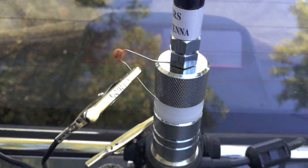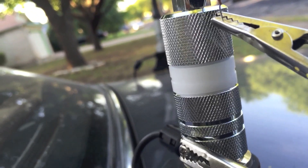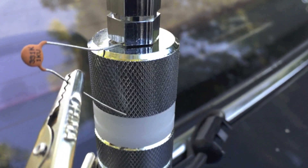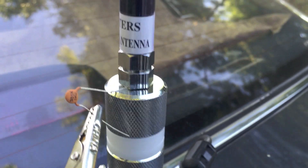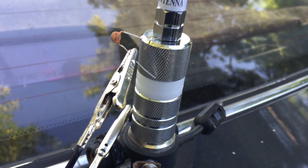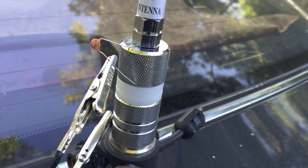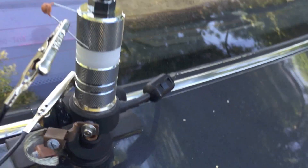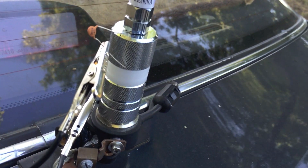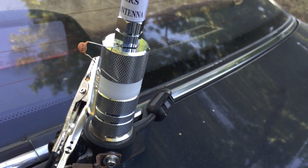Well, this is what I've done so far. As you can see, I'm just sort of shunting it across the terminals. There's a handy screw on the base of this adapter here and I just screwed it in like that around a cable. I'm a little dubious about that tiny little capacitor passing as much current as this is going to be putting out at 100 watts, but everybody seems to be fine with it. It's rated at 1000 volts — 1 kilovolt. So this is the 330 picofarad capacitor. I actually wanted to get a 270, which may or may not have been a better option, but Fry's was out of them. So 330, and then 100 picofarads was the next step down they had in stock.